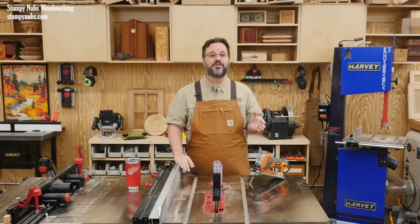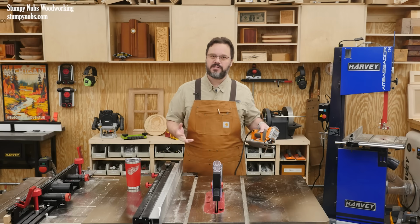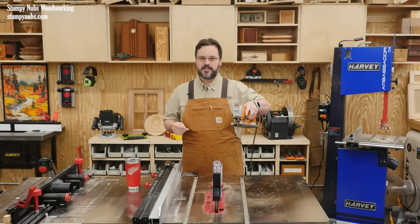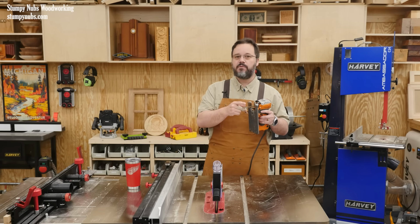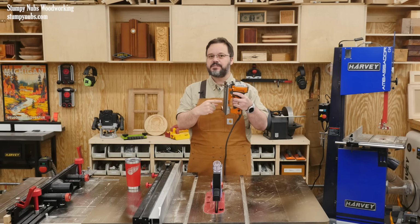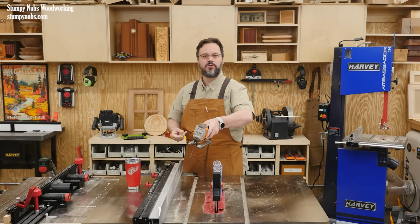Deflection is most common during curved cuts because folks tend to steer the saw by moving it sideways. Examine your technique closely. You might find that even though you're rotating the saw, you're still pushing it to the side a bit. I think another cause is a misunderstanding of where the pivot point of the saw is. It should be at the front of the blade, not the center of the base. So don't twist the whole saw, pivot at the front and let the back follow the blade.